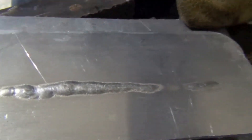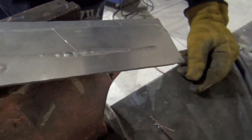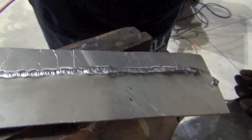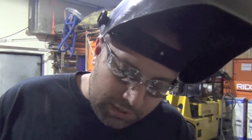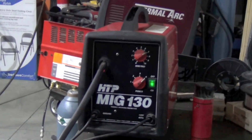We have this typical one-inch to inch-and-a-half cold start on the wire — the same thing you see on a spool gun. As far as penetration, you can see there's a little bit coming through — that's probably good enough. You have really good penetration once the material heats up. This machine is well capable of welding eighth-inch material with very little or no modification. For hobbyist and home-owner purposes, this is a really cheap and successful way to weld aluminum with adequate penetration and good looks.